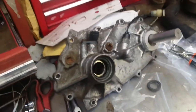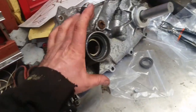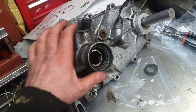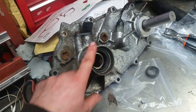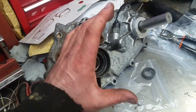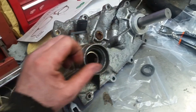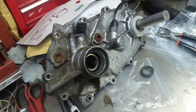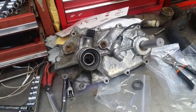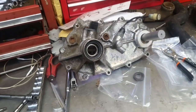We're going to have some flanges turned up and pressed onto the outputs, TIG welded on, and that way we can put some rubber bellows on there. Drive shafts onwards will all be on the wet side. Get it all sandblasted up, cleaned up, whatnot.